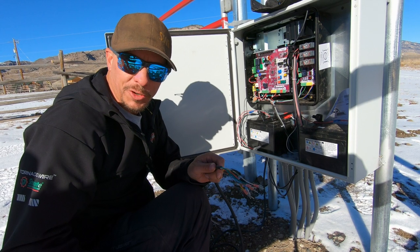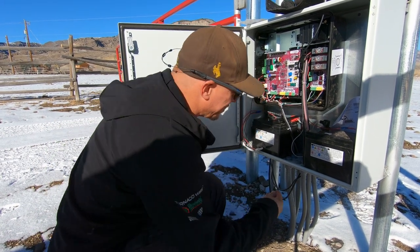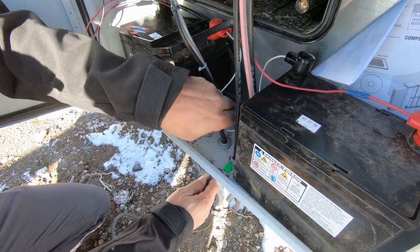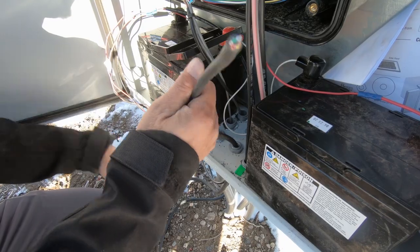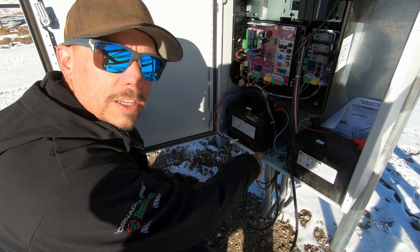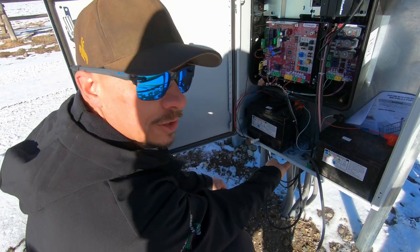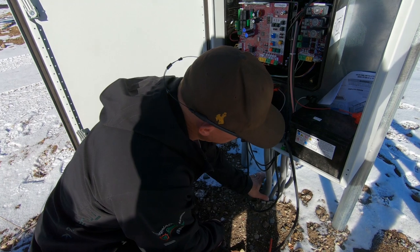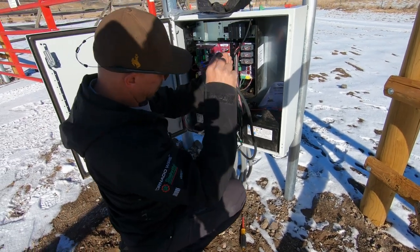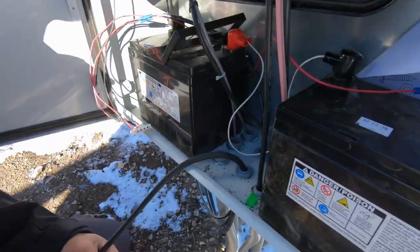This is another thing that sets us apart: rather than wadding all this wire up inside the cabinet, we'll trim it to the right length so there's not a big rat's nest in there. I'm going to show you something that'll blow your mind — you can actually cut these wires. And here's another thing: you can take a hole saw made for conduit and put holes in these cabinets wherever you want, so you can properly terminate your conduit. Most people just cut their conduit off and open their wires into the cabinet through some big butchered hole, but they actually make bits that cut holes in metal.